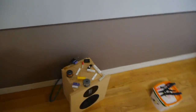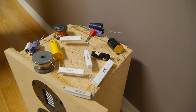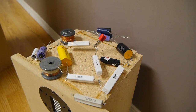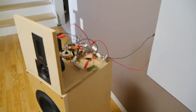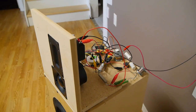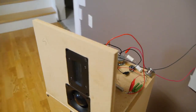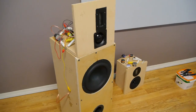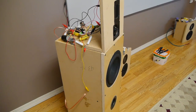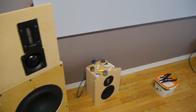These crossovers really depleted my parts bin. Thankfully the Viowave uses far fewer parts to get it where I need it. For the Fountech I put in a fourth-order crossover — I don't do that very often, but it just needed to be smashed into place. These aren't small boxes, but they're not subwoofer size either, and we're only talking about a single eight-inch woofer.